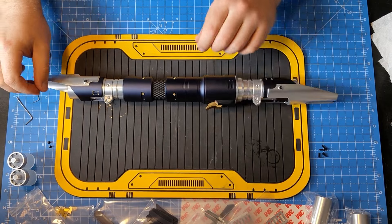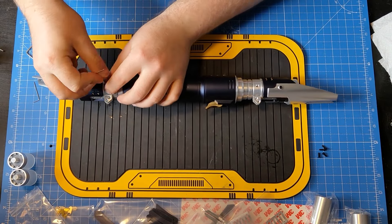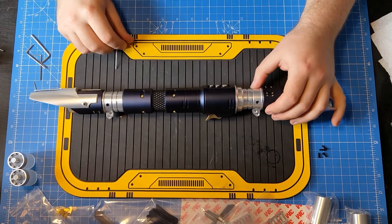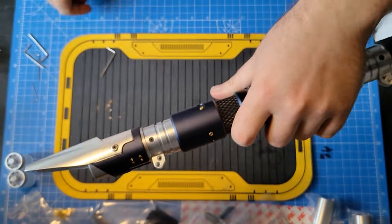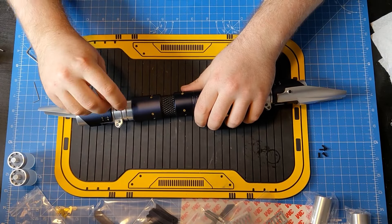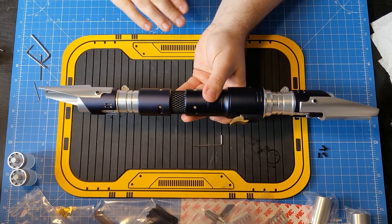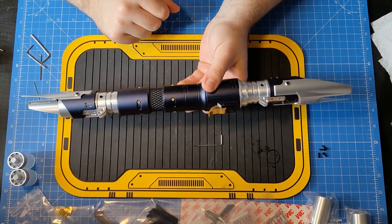I'm going to go over another trick with you that this holds. Grab your 1.5mm allen key, grab the screws, go back into the collar here. Let's tighten them down all the way. If you've set this up correctly, they will go quite a bit sub-flush — the heads will go quite a bit sub-flush to the outer diameter of the rotating collars. So now those are locked, you can't rotate them. But if you back them out a little bit, only a little bit, you can now rotate your collars. And note — they will not go beyond the 180. They firmly click into the 180 position and firmly click back as well. Which is really nice. It's going to be a lot easier to do with the ring on it because you have more leverage. Really cool. I'll show you that a bit better once we've got the rings back on.